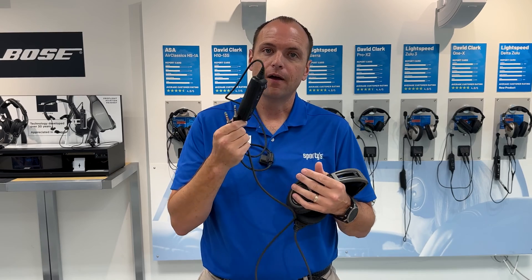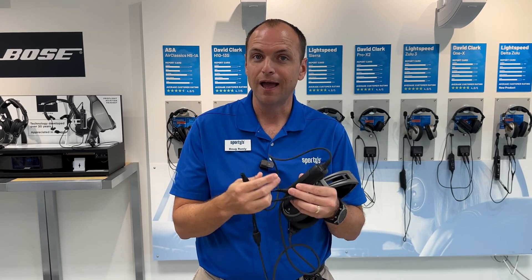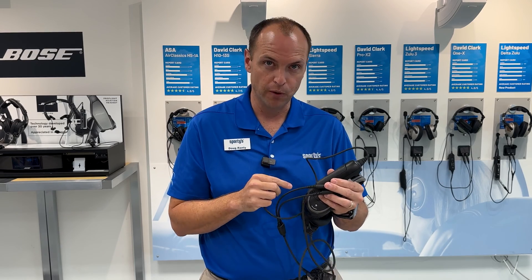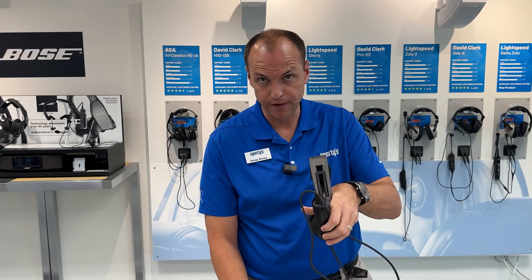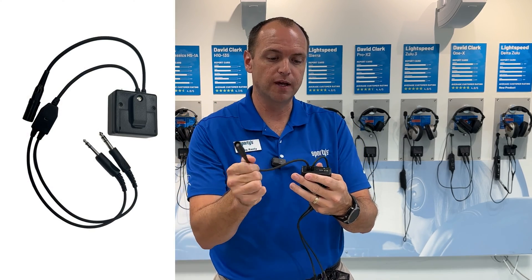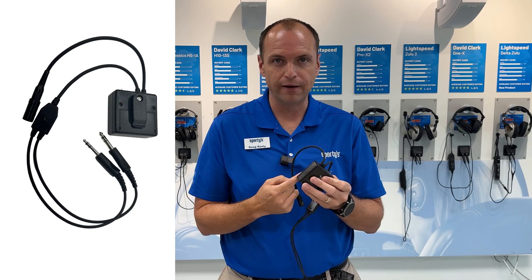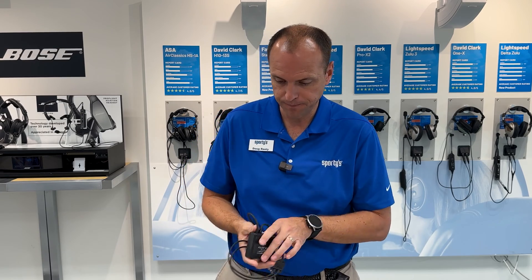Life is good — unless I don't have the battery pack. Some headsets offer a Lemo edition where they've changed the size of their battery pack to be as small as possible; as such, they don't include a battery pack. The two that come to mind are the Lightspeed Zulu 3 and the previous Bose model, the X or the 10. To use one of those headsets in a GA cockpit, you need power — that's where a special adapter comes in. It has Lemo on one side, PJ plugs on the other, and a power source in the middle using a nine-volt battery to power your ANR box.